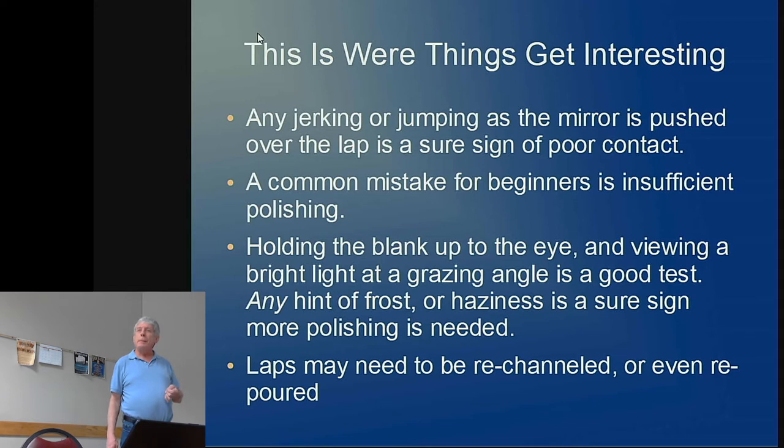I'm still not following that. The pitch is on a convex surface. Yes. And you're then going to be polishing or working on a concave surface. Yes. But if you pour molten pitch in there, it's going to level, isn't it? Well, it will level, but then what you have to do after you cut the channels is take steps to press the mirror down onto the pitch. So you reform it. Yes. So it's going to take the form of the mirror. You better have that right. You better. Yeah. All right.